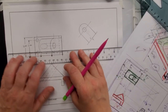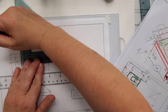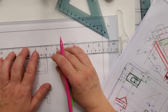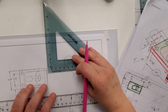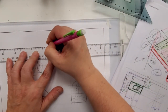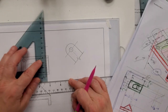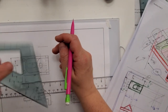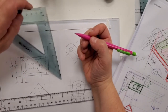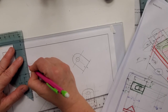Then up here, I've got my next dimension, again, half an inch away from the part. Now you notice I'm not totally picky about exactly, just I've got it close, half an inch away from the part. And I'm not being real particular, as you're seeing me being particular, sorry about that. I was trying to not be too particular. I'm putting in my dimensions, but I'm not being too picky about how much exact room I'm giving it. But I am making sure I get that gap in, because it's easy. If you put your ruler right there, it's easy to get the eighth inch gap. You just stop your line an eighth of an inch away from the part. When you drop your ruler, that's why I say dimensioning by hand is actually faster than CAD.